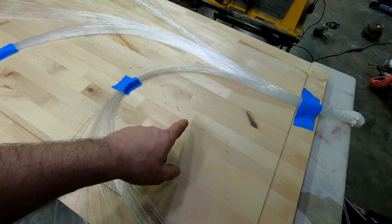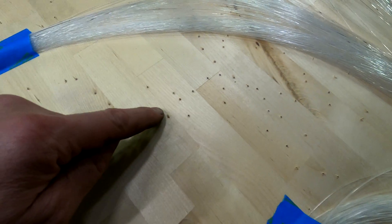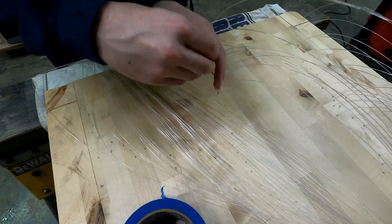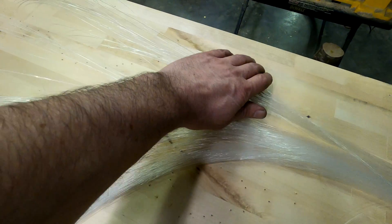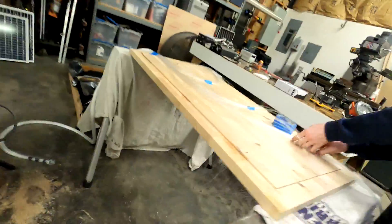We've got the backside of our board here. If I move in close, you can see all the holes that were drilled from the burn traces on the top. We've got a bunch of these fiber optics already run through the holes from the backside. We've kind of got them grouped into bundles. After we've got all these run, we're going to group them into even tighter bundles and get them as close to the board as we can with some cable clamps. Looking under the board, they're all running long right now and we will trim them flush with the board, because they're all going to be encapsulated in the epoxy.